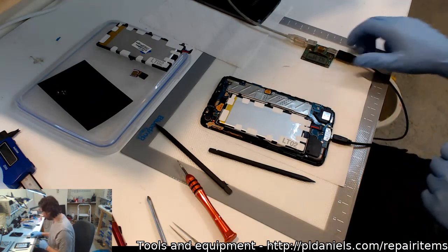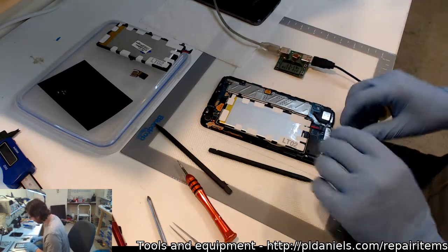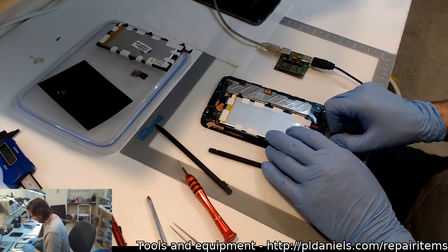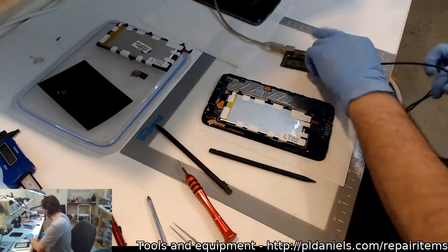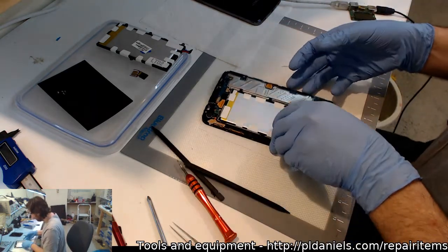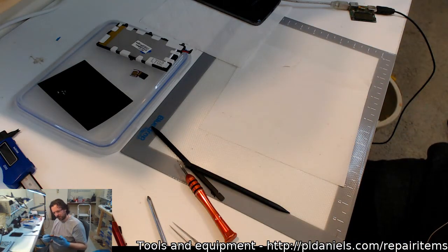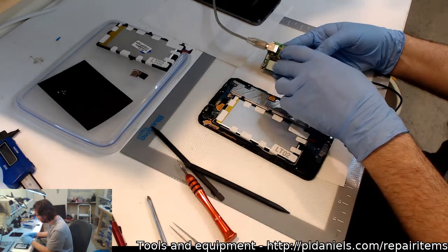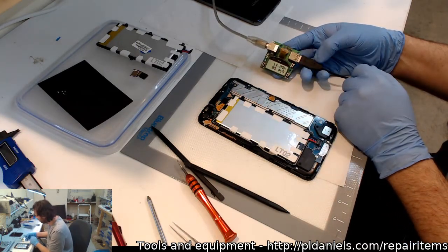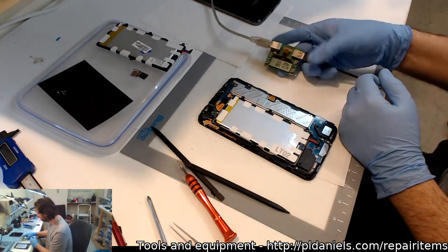Well, Paul, yeah, those inline USB meters are so cheap to get. This one, sure, I made this one myself, but you can get those $4 ones off eBay so cheap now. Hell, they're probably even $3 now. There's a couple of things I miss on them. Like this one, I have my cumulative milliamp hour, but I've also got my current trip on it. So if I go over a certain current level, it disconnects.